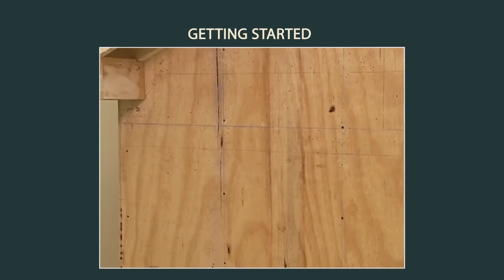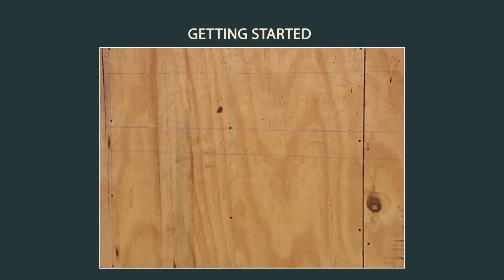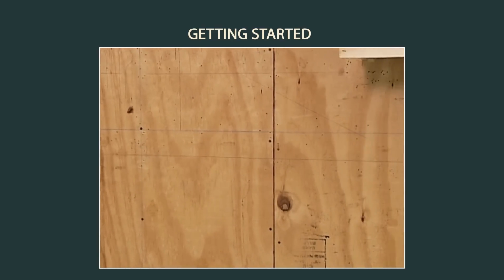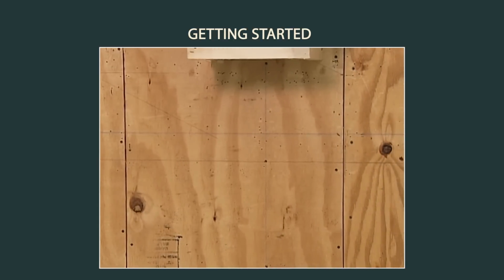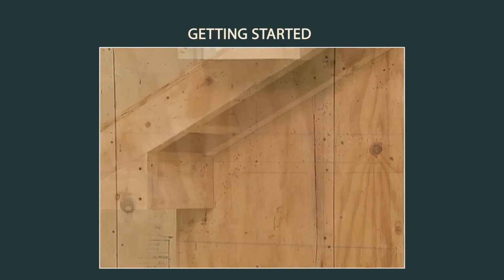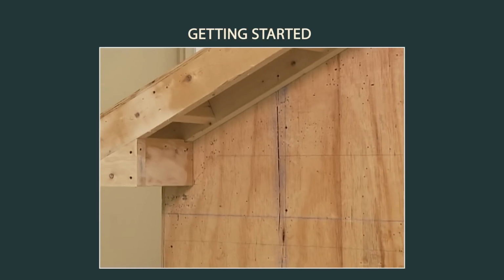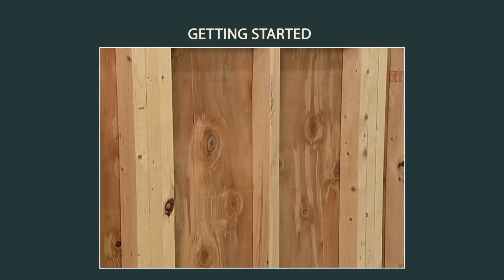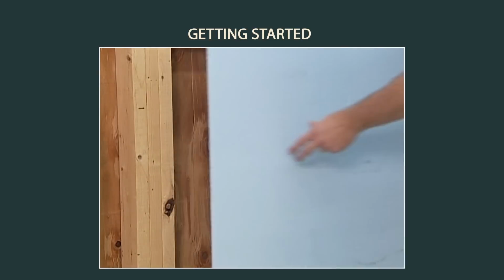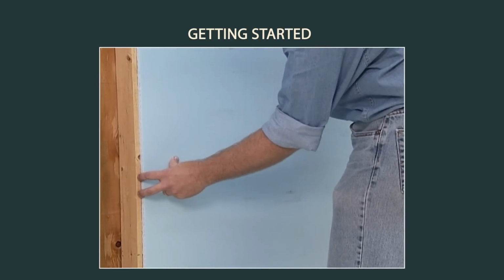Vinyl siding is an exterior cladding for existing structural walls. Vinyl siding should always be applied over some type of backer board, never to uncovered stud walls. In new construction projects, OSB or plywood is commonly used. In some areas, it is acceptable to use a solid foam board as backer board.